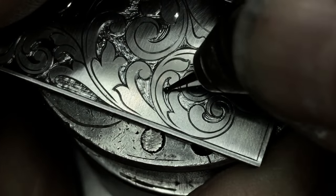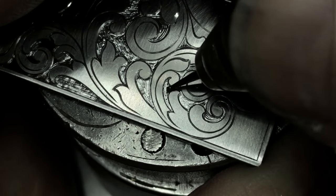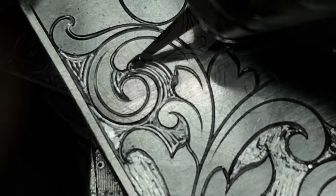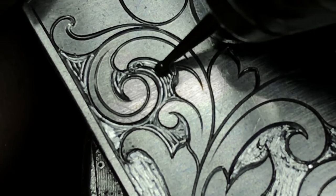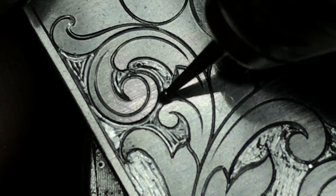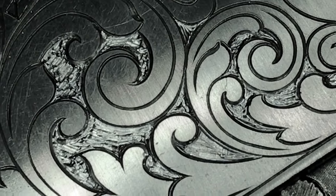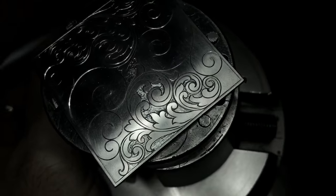The handpiece will run off the air from any GRS unit. I use it on my Graver Max G8. It spins at about 330,000 RPM and doesn't have a lot of torque, but it nearly vaporizes metal. Its only downfall is that it needs a really practiced hand to keep it under control. You can wipe out quite a bit of work with one errant swipe.